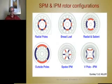Now let's look at this one first. This is where you take low-cost ceramic or bonded magnets and you mount them internally to the rotor core like spokes, and these magnets have the shape of being slabs, and they're parallel sided. And these parts here are soft iron pole pieces, usually laminated, punched from the stator laminations. Cheapest way to do it. You can put a hole or a slot in there to stack them up and support them and assemble them with.